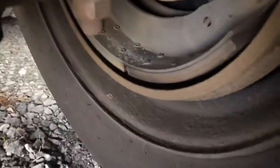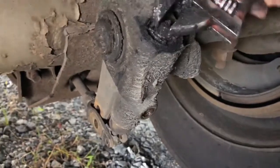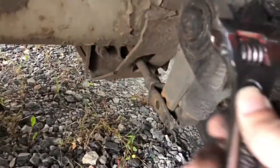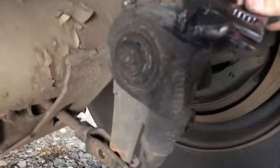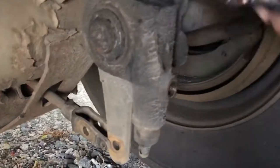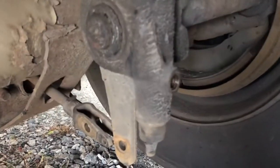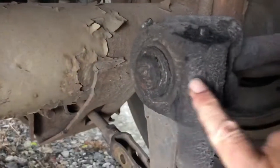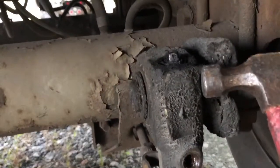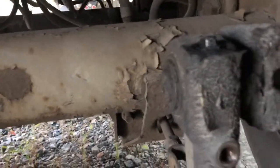Right now the shoes are coming off the drum. See? It turns the S cam. Here it comes. See, watch. See it coming out? Now the craziest part is these things getting seized on right in here. Sometimes you gotta burn this stuff off here. Come on, pray a little bit before you try. It's going. Man, this thing is just being nice to me.